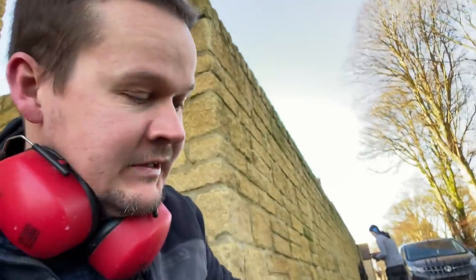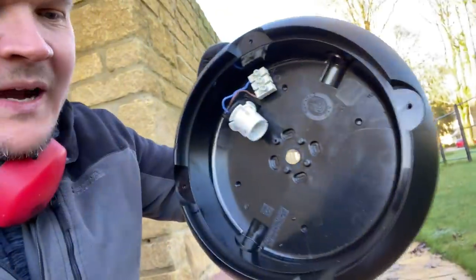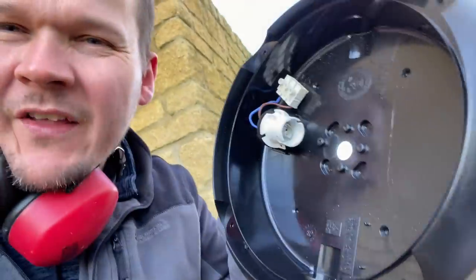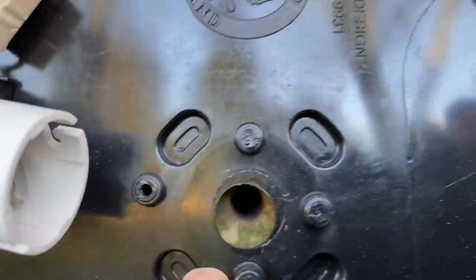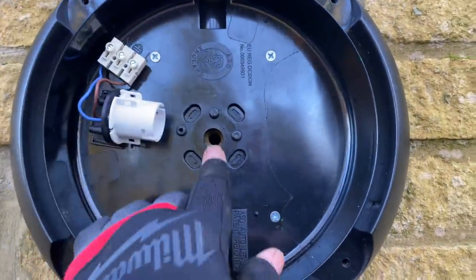What I've noticed — obviously where the lamp is — our conduit's going to be that way. The lamp should still illuminate because it's got the backing plate and the reflective pie dish, so it should still be okay. I'm going to drill out the holes, put the four fixings in. The good thing is we can get all the lights up and then just do the tube work after. I've got my light up — see that little pinprick there. I'll drill this out to 25. I'm not going to put a bush coupler on there, just plastic black — it'll run straight in using 20 mil.